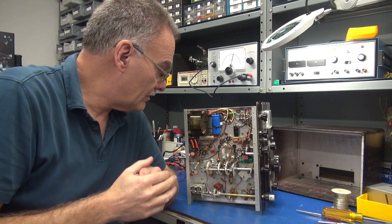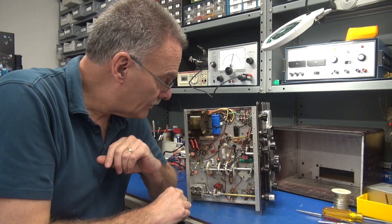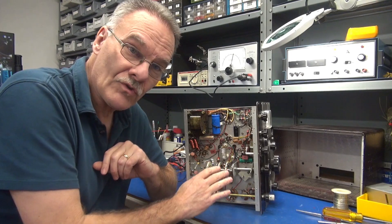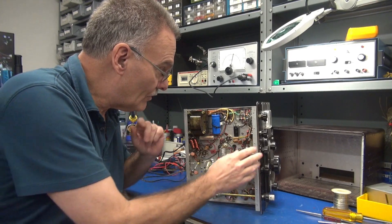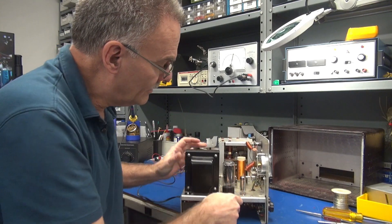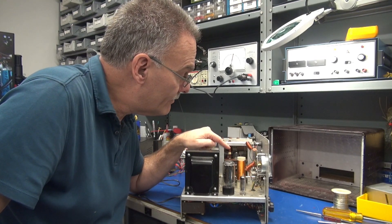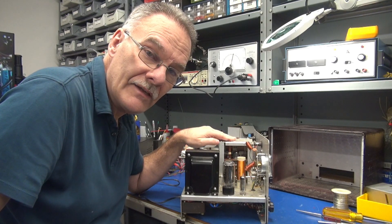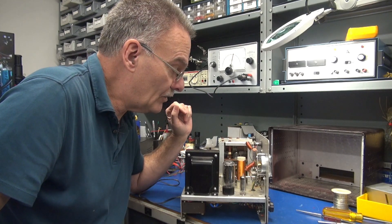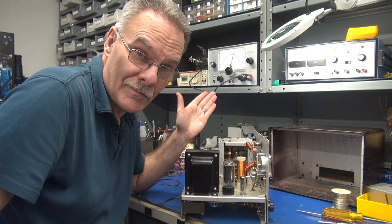I upped the filter cap to 40 microfarad at 500 volts, and this guy over here — the 33 microfarad — is for the negative bias. I think I've reached the point with the Navigator that I can try an initial power-up. Got the new filter caps installed. Had to reverse a lot of wiring — I found extra wires going up into the VFO, so I had to remove the cover from the side of the VFO and work with dental picks and inspection mirrors. This one does not have the OA-2 voltage regulator inside the cage. I'm going to power this up slowly on a variac, watch for shorts, make sure things light up, and hopefully get high voltage and some output.